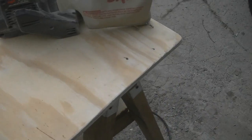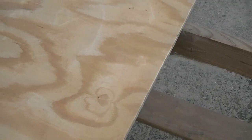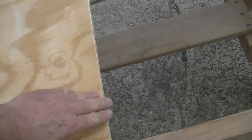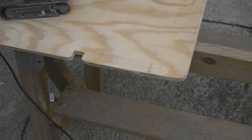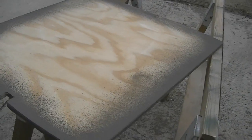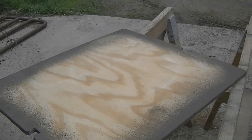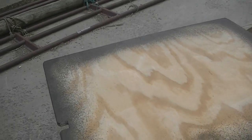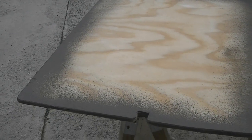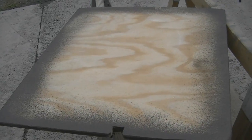On these boards, I've just lightly taken the sander and lightly beveled the edge, because I've done this once before and didn't bevel the edge and found over time the sharp corner wears through the edge of the carpet. So we're going to bevel the edge a little bit more and then coat it with that bed armor. That bed armor really coats nicely — I went all the way around the edge. You've got to keep shaking the can every minute or so or it'll come out in little splats, but even the splats level out.